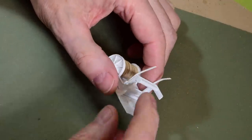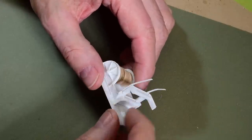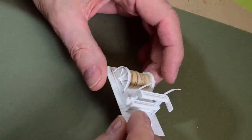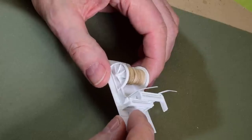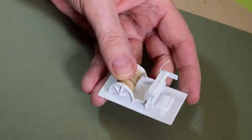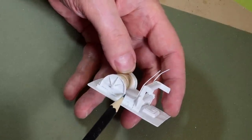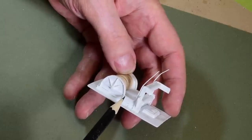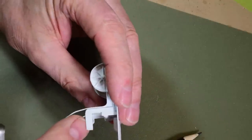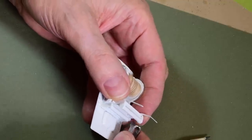Moving right along — this winch is turning out to be a lot of fun to build, probably one of the funnest components so far. It's not exactly the prototype, but I'm using a little bit of my own engineering license to dress it up, because a lot of the details you just can't see from the limited photos available. Here's an example of using trim for doing metalwork: this is 80 thou by 15 thou — just bend it into the corner there, it bends easily. I'm going to wrap it around here; I've packed out with some scrap there and I'm just going to snip that off.